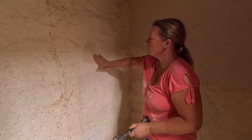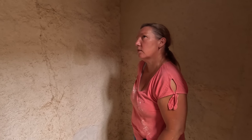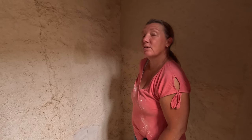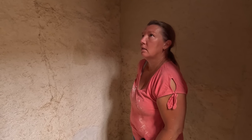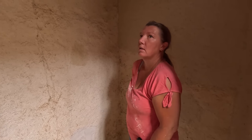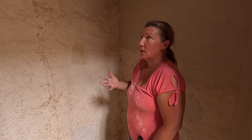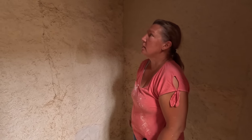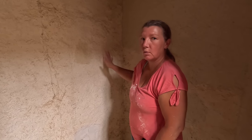So, do you have anything else to say? Did we learn anything interesting today? I was thinking as I was doing it, is it easier than doing drywall or plasterboard? And I think yes. For a DIYer, I think plastering over hemp and lath and plaster is a bit more forgiving than trying to do a plasterboard finish, which has to be 100% smooth, and you can see all the imperfections. Whereas this has imperfections, but the whole house has imperfections. They're intentional imperfections. Exactly. And it gives you the confidence to think, well, it doesn't really matter if there's a few dips.